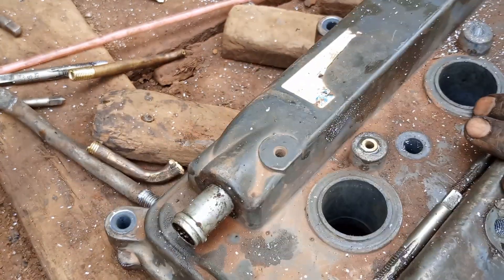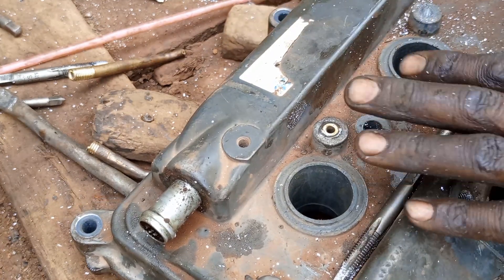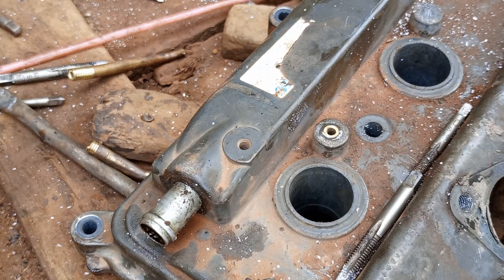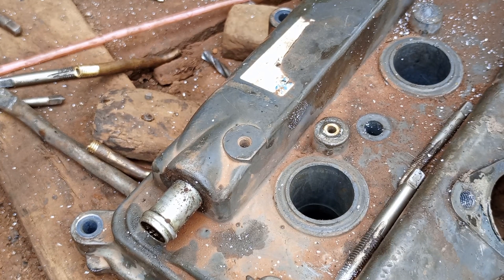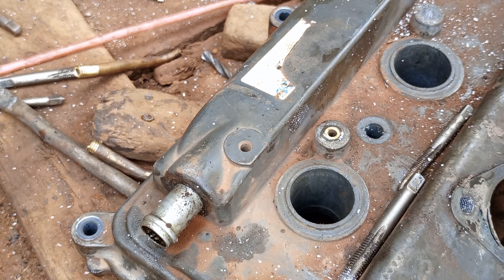After tying in our insert, we have to make this surface a bit flat. So we are going to put a seat. We can use any bigger drilling bit — let's first use this 8.5 millimeter bit.